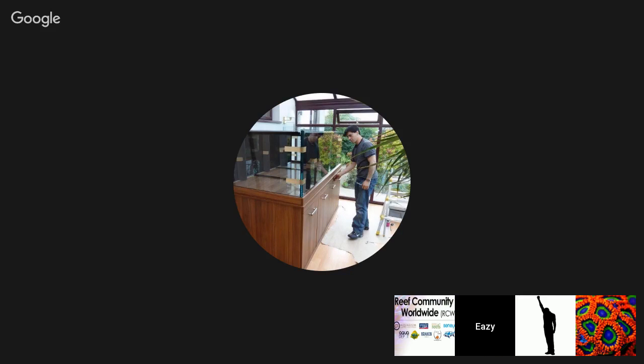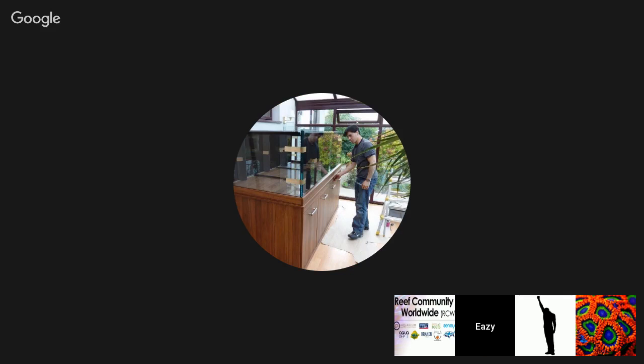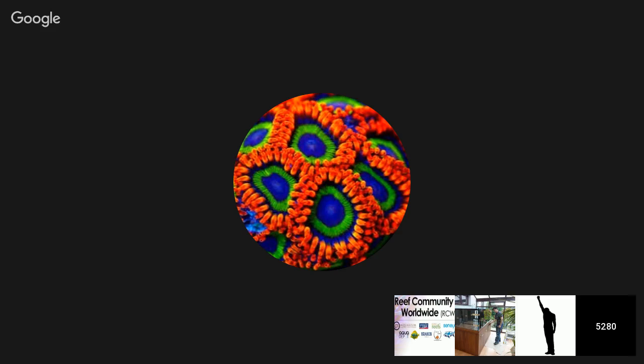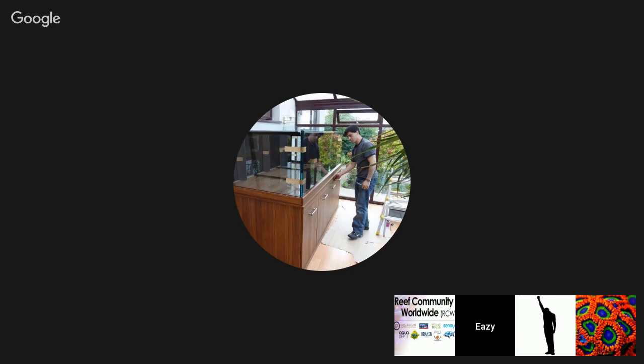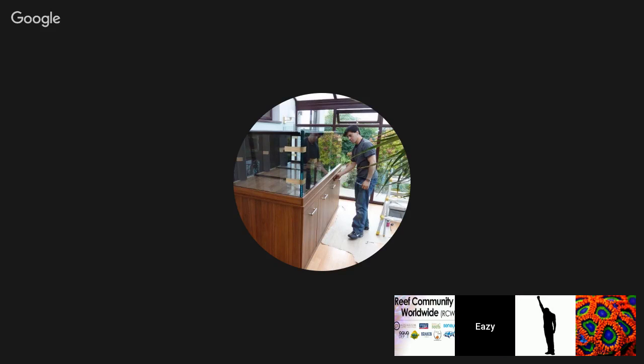Yeah. But those things are going for $700. But there's off-brand ones coming around now, which are a little bit cheaper, but still, that's at 615 watts, which produces an equivalent of a 1,000 watt metal halide. So if they can make one that's probably like 300 watts, you know what I'm saying? For the marine industry, 300 watts would be beautiful. It'd be perfect. But they produce literally half of the heat that the metal halides do. They produce twice the light output at half the watts. It's ridiculous.